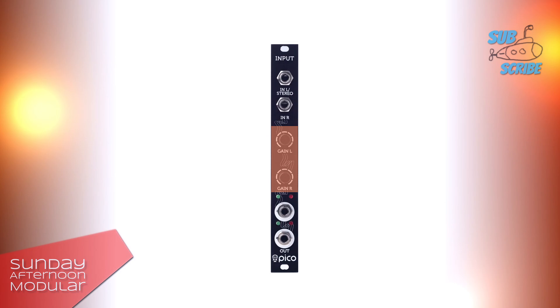There is a jumper for each channel on the main PCB of the module. If you remove the jumper, the channel will have a boost of plus 20 dB. Then we have two mono outputs, one for the left and one for the right channel. There are LEDs for each output that give a visual feedback on the signal level.